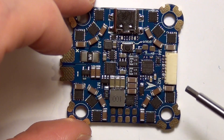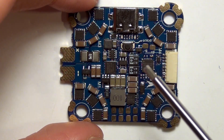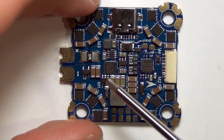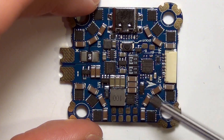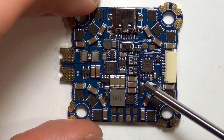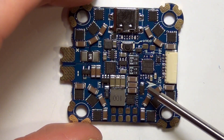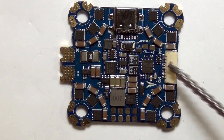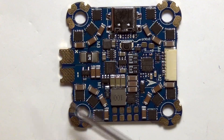This can accept 2 to 6S LiPo voltage. It is important to realize this does not have an OSD chip — no analog OSD. It's really meant to connect to a DJI air unit, though you could use it for other things. It has a 2.5-amp 5-volt BEC for powering peripherals, a voltage sensor and a current sensor, a beeper pad, RSSI, 4 motor outputs, and an 8-pin connector to the DJI air unit. It's a 30x30 configuration with 4-millimeter holes that grommet down to 3-millimeter, and about 40.5-millimeter square on the outside edges.